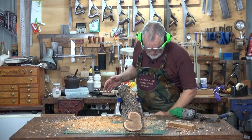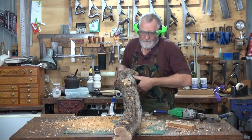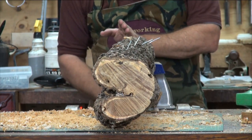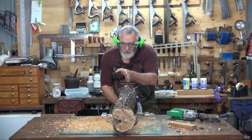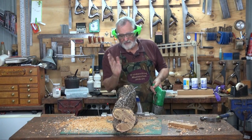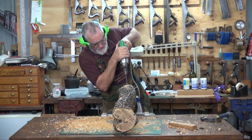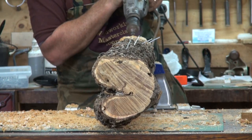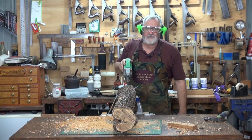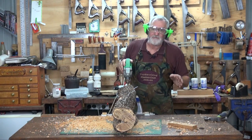I was told there wasn't much skill involved. Now we turn it over and do the other five, keeping it in line. I've got five holes down one side and then the corresponding side on top — that's what I want. You don't want the bottles to lean back so they hit the wall. Go straight and then tilt it back a bit. This is extremely hard timber — it's a desert timber from far western New South Wales. If you were using pine or something softer, it's going to be a lot easier.